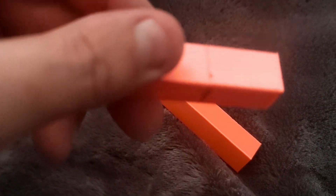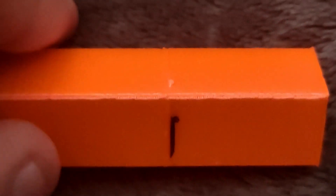This bit where the power resume was - I'm going to attempt to zoom in. You can see there where that little ridge is - there's a little bubble just down there which is where the nozzle finished when the power cut happened. But as I say, it's incredibly strong - I'm putting some real pressure on that and it is not breaking. It doesn't seem to be obviously weaker, though it's going to be slightly weaker, but it's definitely stronger than I thought it would be.